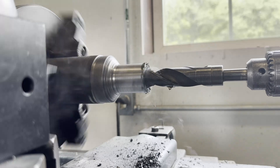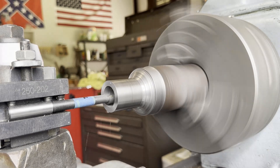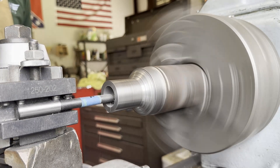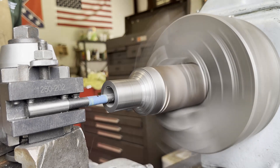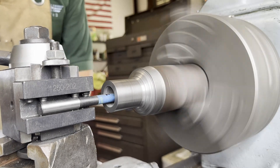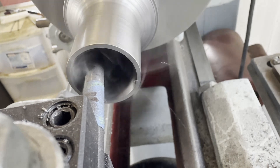Here I'm boring out the center with drill bits - a half-inch bit first - then I had to switch to the boring bar, an Amazon-supplied boring bar you can get in kits of 12. I've got three allen screws cinched down on this boring bar to eliminate harmonic vibration: two allen screws and the tool holder are tight on the polished part of the shank, and the third allen screw nearest the stock is just touching the bar to kill the vibration. I've also got tape on the shank with two marks - one is the 'hey wake up' mark and the other is the 'you're about to hit the bottom of the hole' mark. On the first mark I disengaged the automatic feed and hand-fed that last eighth of an inch or so.